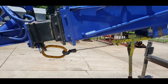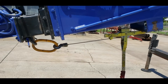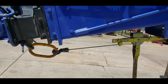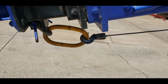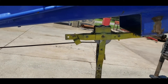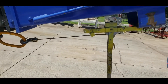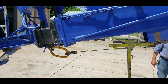This is part two on recabling the 52XLR. This is an important step since we've removed the extension cylinder — that's part of what retains the main section. We've placed a retainer on here; you could use a chain, but we're using a come-along so we can control the extension and retraction on it. I'll pick up again on this when we get inside.